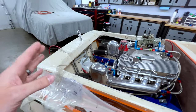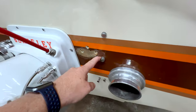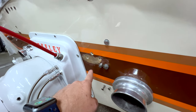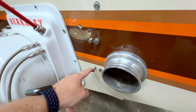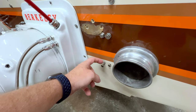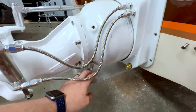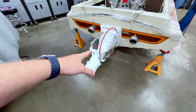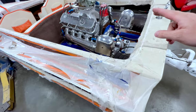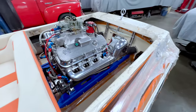One of the main things I need to do is go through and measure for a bunch of hardware that I need. If you notice back here when I mocked up my hardware for those brackets for the fuel lines, I just have these flat-headed tapered bolts in with the nuts just to take up the length. I need to measure the actual length that I need here - this is a great example, it's bottomed out in that bracket and going to be far too long for my swim step bracket. So I need to measure what size bolts I need for all these on the transom so I can get those on order. Same thing for the hardware for the ride plate - it's just mocked up with hardware that's not going to work. I need to get hardware for the loader for the pump. There's a lot of small things and little details, and I'm doing all that so I can make one order with all the hardware in one shot.